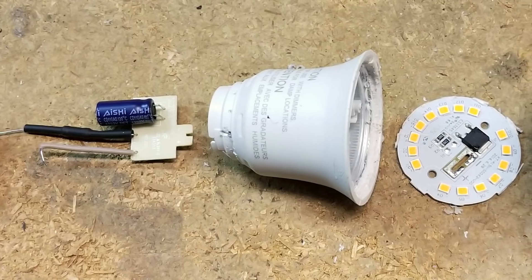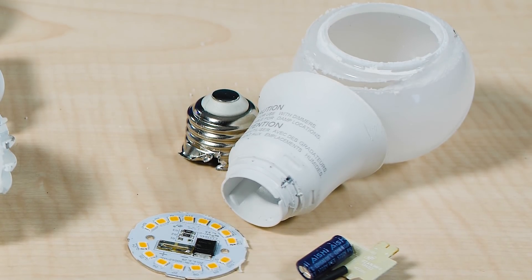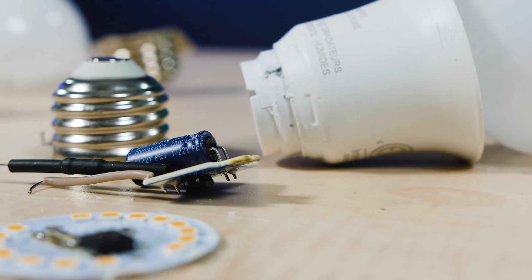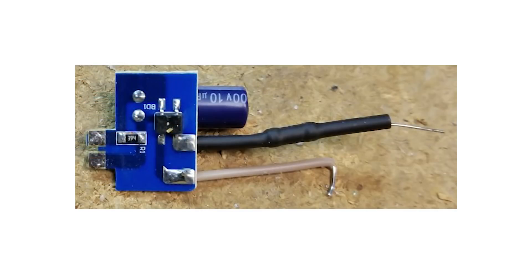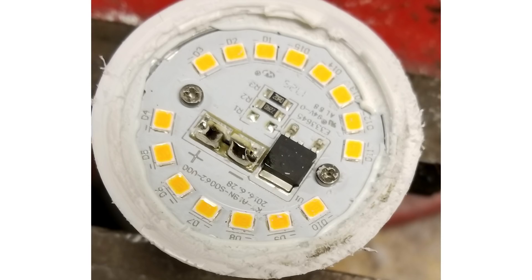We now turn to another undimmable bulb, this one from Sylvania. If there was a prize for the simplest possible LED bulb, this one might be a winner. It has the fewest components we've ever seen in a bulb recommended by Consumer Reports. It uses discrete wires to make a connection to the bulb threads and base, but the wire to the bulb base isn't really a wire — it's actually a leaded fuse. So Sylvania cleverly used the fuse leads in place of a wire to reach the base. The PCB on this one slides into a plastic carrier, and the LED driver circuit is dead simple — there's no driver IC.